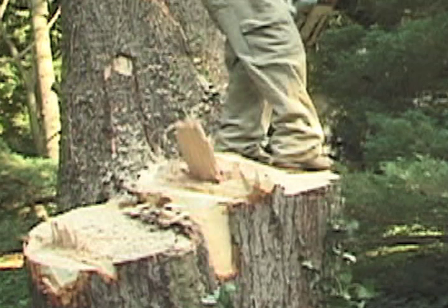The silver maple stump that I'm standing on has a very, very thick hinge. Silver maple is a very poorly hinging wood. The piece had a lot of side lean. I was trying to get more control by cutting a fatter hinge. That hinge was probably 6 inches wide and maybe a 3-foot cut there, or even less. So that was well over 20%, or at least 20% of the diameter of the cut, and it worked extremely well.